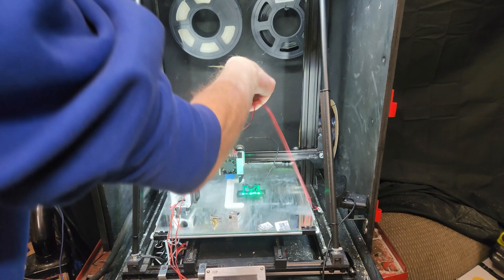To sum up: if you need temperatures over 250 degrees Celsius or you're using abrasive materials, you might want to switch to an all-metal heat break. For PLA, PETG, and ASA — my three most common materials — the PTFE style is likely to produce better, more consistent results. You can even increase retraction without worrying about jamming, thus reducing stringing as a bonus.